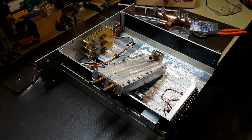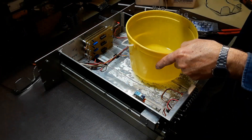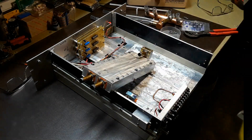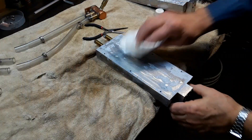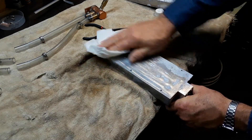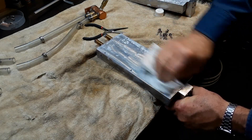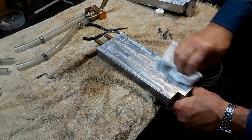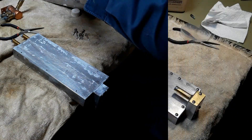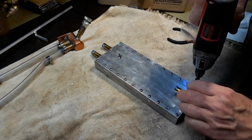This time I used my head and got prepared for a little bit of water drippage. Then the messy job of getting the old heat sink compound off the heat exchanger so it doesn't spread all over the place — and get it off the chassis of the amplifier also. I find using a little bit of alcohol with a rag and just keep wiping works well. So with all that goop wiped off, you can start working with a clean surface.